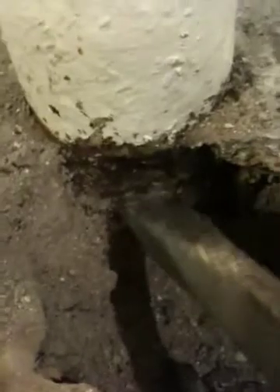Here's the lally column. It's painted here, and below grade you can see some rust which has occurred. This is a dry basement, but I think maybe water vapor played a role, or maybe water was under here at some point. The concern was that the steel in the lally column seemed to have rusted away in this location, and we actually have what appears to be a concrete exposure through the lally column. So that got me wondering whether or not this column has been compromised.